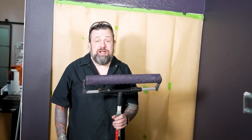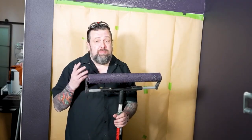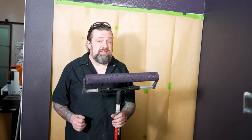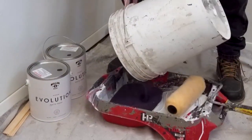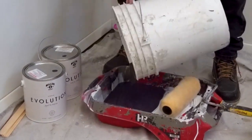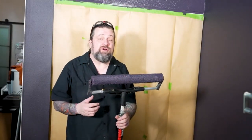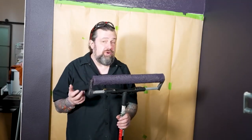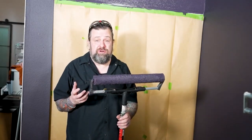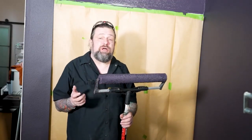All right, guys, I learned a couple things on this project. First off, with our plastering technique, you gotta be really careful with the color that you pick. So if you're doing a dark and moody color like this, the plastering technique is gonna dilute it down with all that white sheetrock mud and make it more pink, purple, blue, or whatever color the base is. So you really wanna take that into account. It's better for grays, light tones, like earth color tones, because that way it'll match the room and not take away and make it a lot brighter.